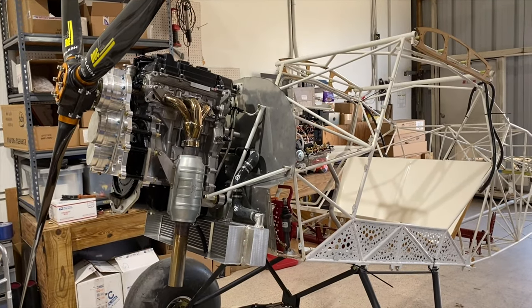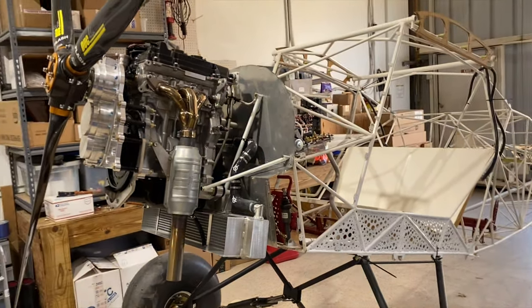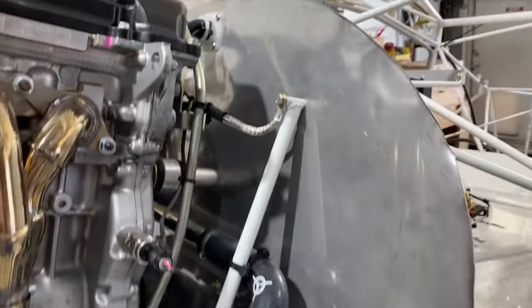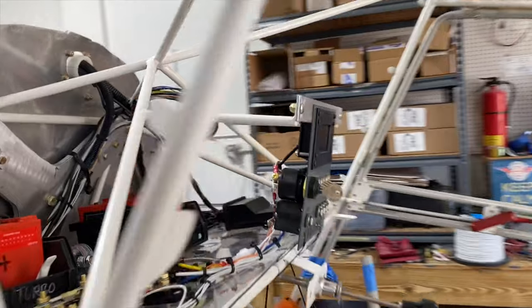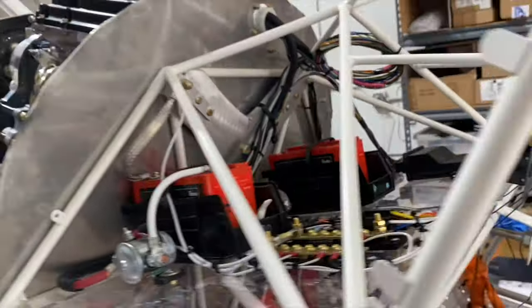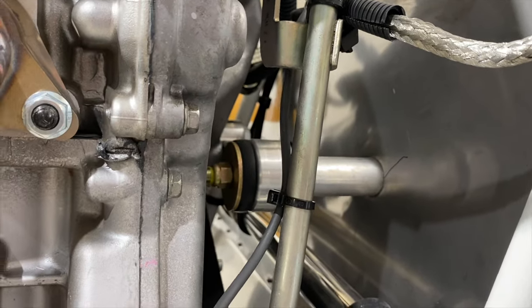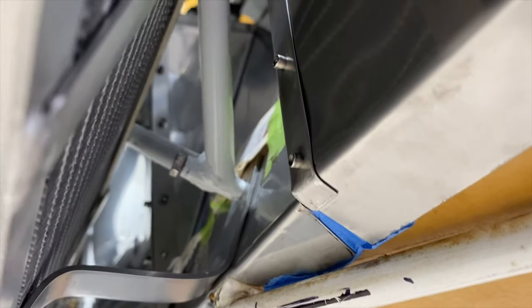If you have a Kitfox 4, 3, whatever, that'll fit the same size as this one, it'll fit the 90 engine. First thing you're going to do is grab your engine mount. This engine mount's a little bit different than a production one because it was the first one we made. They're all going to have this star-shaped aluminum piece in the back, and that's just to bridge into the center with something structural from the four original mounts, and it gives us a nice solid mount here in the middle top of the three-cylinder engine.